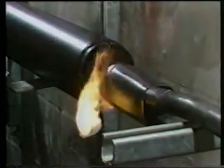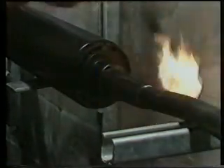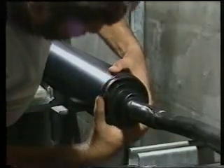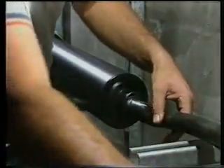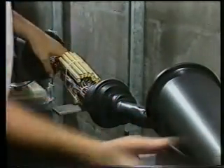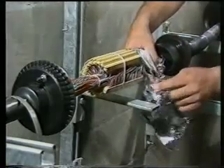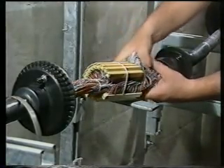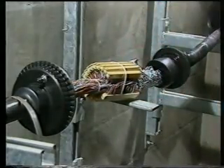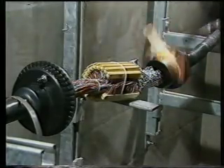Step 15: Now shrink the small end cap. Step 16: Shrink the outer heat shrink sleeve of the small end cap into position. Then disassemble the closure and slide the main body back down the cable, thereby exposing the inner heat shrink sleeve of the small end cap. Step 17: Protect the splice area with aluminium foil or another suitable heat barrier. Step 18: Shrink down the inner heat shrink sleeve. Complete the earth continuity bonding.